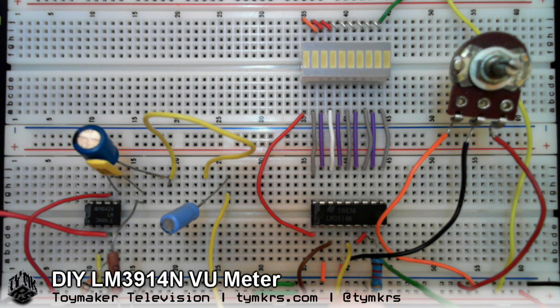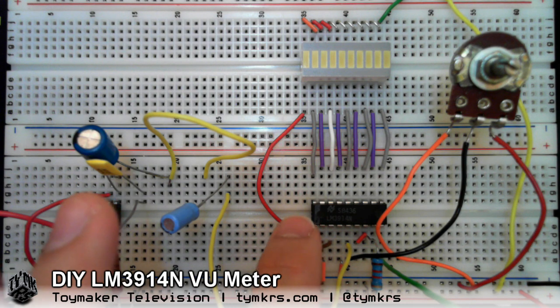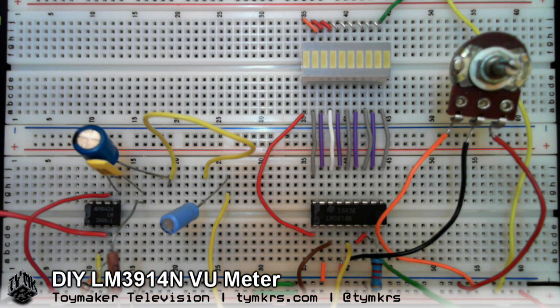So this chip — I used the data sheet to try to put it all together to get our nice LED blinky lights, but it totally didn't work. The LED acted funny and I thought it was broken, I thought the chip was broken. So I did a couple of things: we added power because we thought maybe this requires more power to work, so I had it go from a 9 volt battery, added a 4.5 volt battery pack. Right now it's running on a 4.5 volt battery pack, but that didn't seem to help anything. I added this LM386 amplifier circuit just because I thought maybe the signal needed some amping up from the guitar, and at that point it didn't really do anything either. So I added our cascade preamp to it — that didn't do anything either.